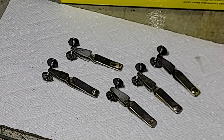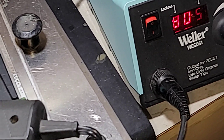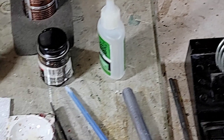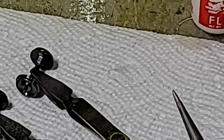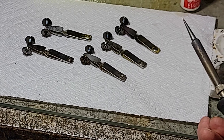Another ingredient here is a very good temperature-controlled soldering iron. I use a Weller — it's up to about 800 degrees. Anything less than about 800 degrees and you don't have enough heat. If it's a very small iron, you don't have enough heat, and you have to put too much heat on the wheel set, running the risk of melting the insulated joint. You also need a very fine tip on your soldering iron. Some people clean the tip in a wet paper towel or wet sponge, but I don't like that because it reduces the temperature on the tip. So what I do is I use my pants — but you could also use a cloth.